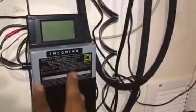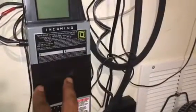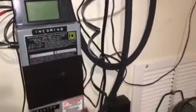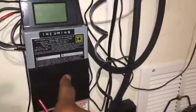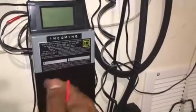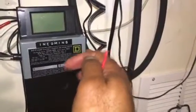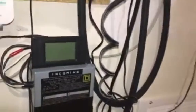And so what I did was I rewired my relays. You see here, I decided to use the cover that came with the circuit breaker box, and I just put this insulating tape on the front to cover up the hole, and I covered the entire back of it with a thick layer of insulating tape, so that the relay contacts won't come in contact with the inside cover here to short out or arc or something like that.